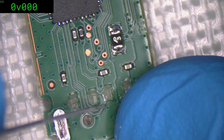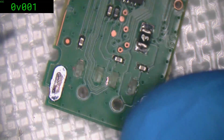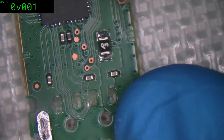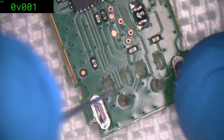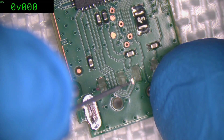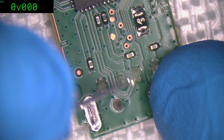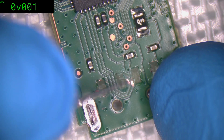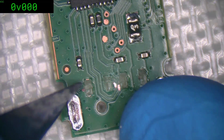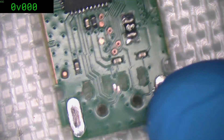It's always fortunate when we get a board in this sort of condition, where it's just a simple physical break. We'll cut that off a little bit where the designer has actually been courteous enough to route the traces on the top layer, as opposed to running vias directly underneath, which is always a nuisance. In this case all we've got to do is just connect a wire to there and a wire to there for our positive and minus, and I think we should be good to go.